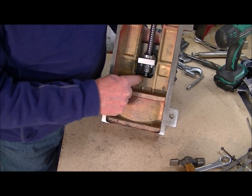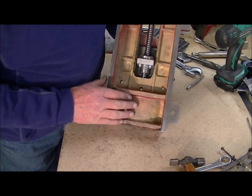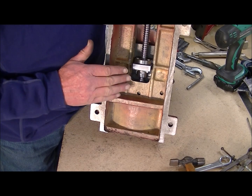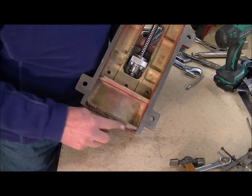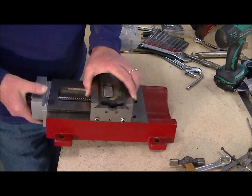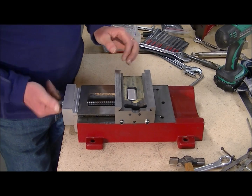I've taken this out with my mill, but you can actually file cast iron — if you've got a good file it cuts like butter. You really just need to take out a little area here. I've machined the whole of this out, actually taken it back about a quarter of an inch, because I had a very rough casting. And plus I wanted to achieve this effect. That is pretty well done.